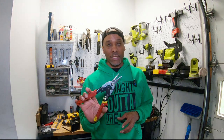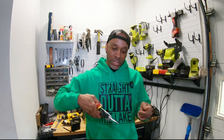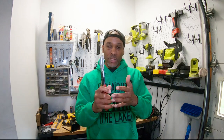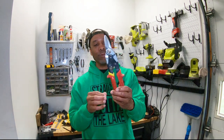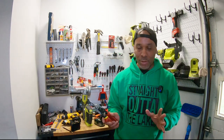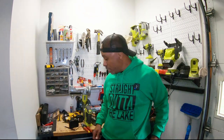With cutting, I also want to mention hand snips — fairly inexpensive and makes life a lot easier. They can cut through 1/16-inch aluminum. I've cut sheeting and some angle with these. Sometimes you need to make precision cuts to fit specific areas in your boat and this is a lifesaver. Picked it up from Home Depot. Note: only good up to 1/16-inch — if you're doing 1/8-inch, this won't work.